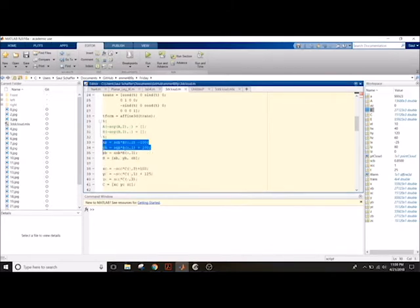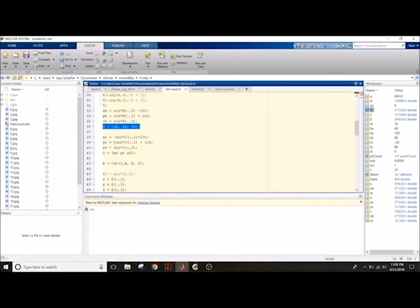So essentially, we're breaking them into their X, Y, and Z components, and then manipulating them, and then concatenating them back into the same array. And so we do that for B and C scan, and then A we leave as the reference frame. And so we combine them all together into E. And then we break that up into X, Y, and Z coordinates, useful for creating the axes.